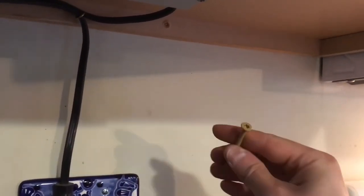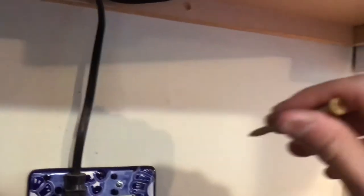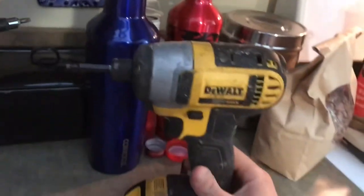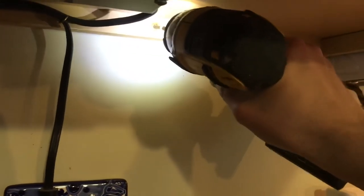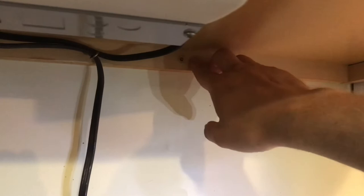So I'm using two-and-a-half-inch screws, and I'm specifically using this brown color so they blend in a little better than a drywall screw would — that black screw head would show up a little more. I went ahead and pre-drilled and also countersunk just a little bit to create a conical depression. Then I set the screw and used my DeWalt impact driver with a hex bit in it. I sunk the screw halfway and drove it the rest of the way. That's it — don't overdrive them. You want to leave them just about flush with the support strip.